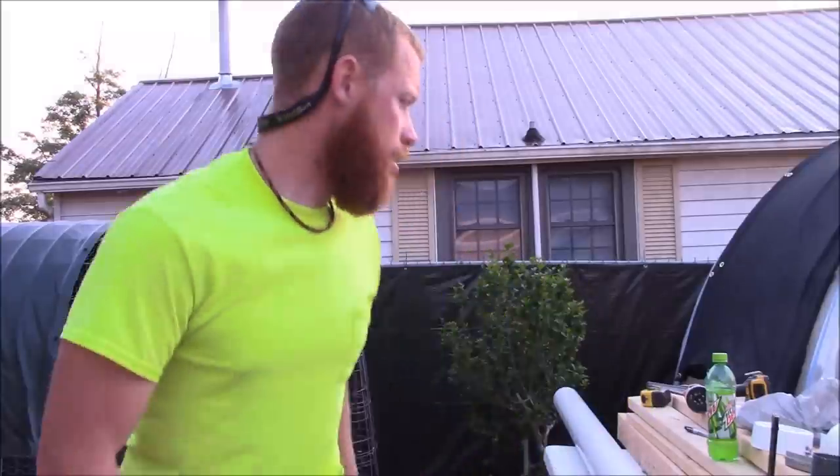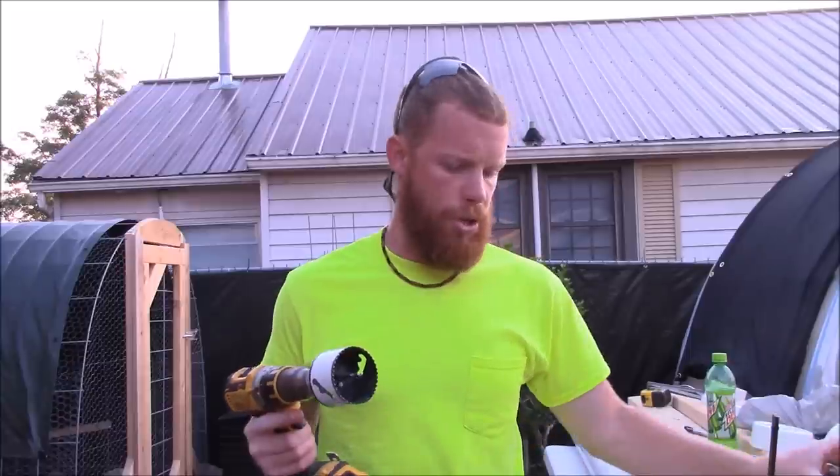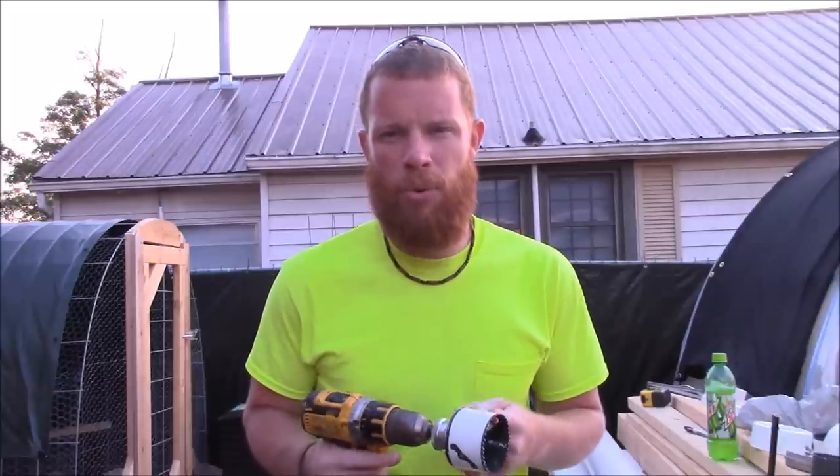Some of the tools you're going to need today are a drill and a hole saw — the hole saw size depends on what size net cups you're going to use. I'm using three inch net cups so I'm using a two and three quarter inch hole saw, which can be purchased at any hardware store or home improvement center. They're a little pricey but get a good one; don't cheap out and get something that's going to booger up your PVC. This is a Lennox — it's a really good product, I use them a lot in construction. I actually had to go buy a two and three quarter inch one because it's not a very common size for me to carry on the truck.